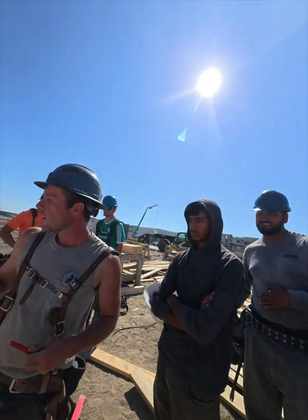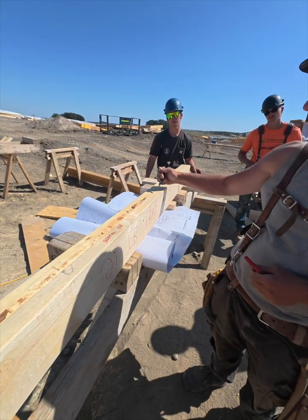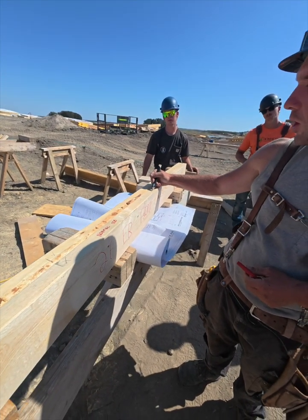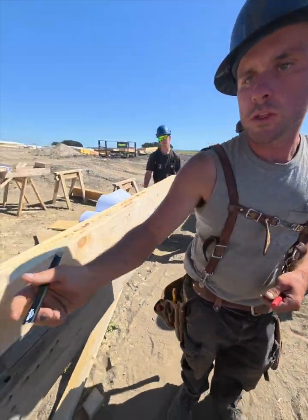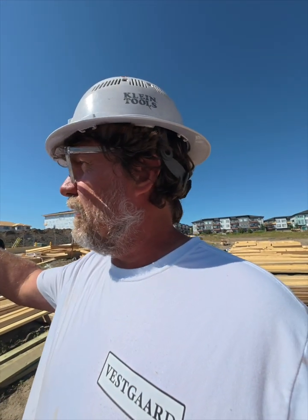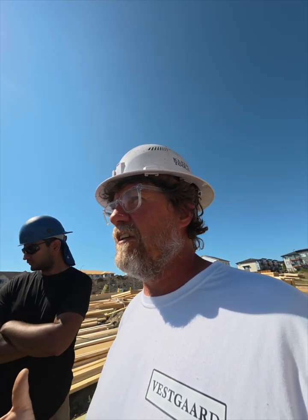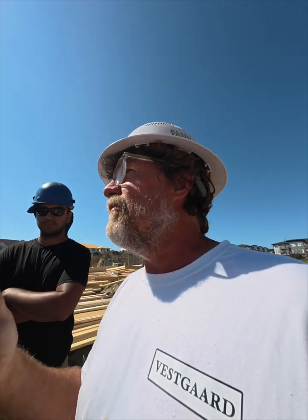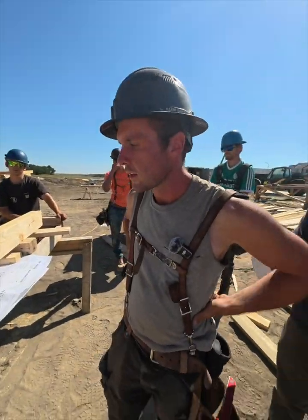Oh, one more thing. On the inside here, there is a block that goes beside the jack stud for the window blocks. They go there, but I never mark them out. It just goes without saying for us. Well, I mean, there is some stuff that the builders of the walls have to know. You know, we're actually pretty meticulous about writing everything on the plates. But there are some things that just go without saying that you learn as you go. Correct. Yeah. This is done.